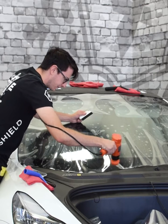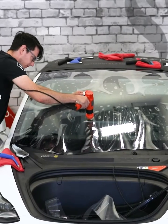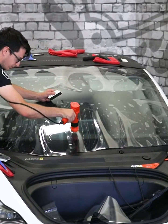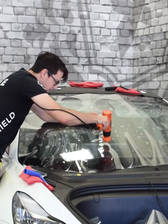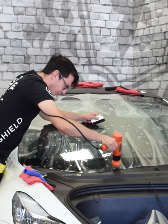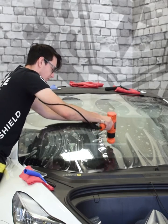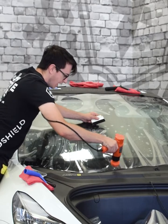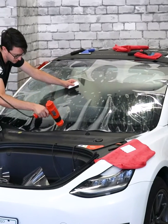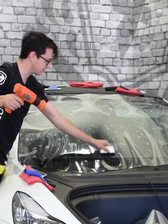We're going to go after one half — same as before: getting the bottom edge to gel and curl, move up one side, down the other, and then through the meat of the finger doing circles nice and close. Keep the bottom gelled and keep consistent heat applied throughout. You shouldn't be focusing on one area more than another. If you're applying even heat to the finger throughout, by the time you get to the end you'll have naturally applied more heat to the bottom. That part of the finger doesn't go away until the very end.